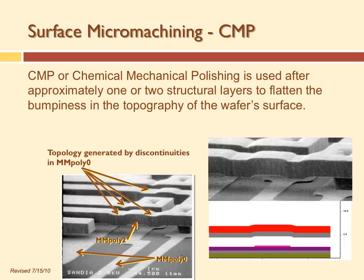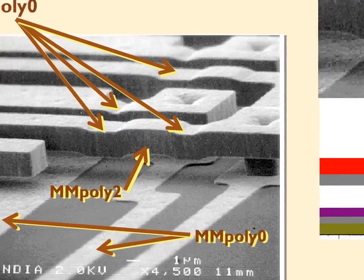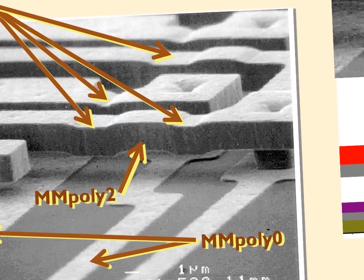After etching, where the photoresist remained it protected the structure underneath; everything else was etched away. This is classic surface micromachining — put a layer down, pattern it, etch away what's exposed. There are ways to etch things, and we also sometimes need to do surface conditioning because as you build layer upon layer, conformal deposition causes bumps to form and the surface gets bumpier with each successive layer.